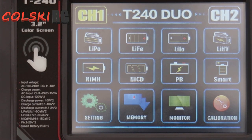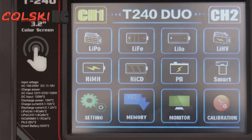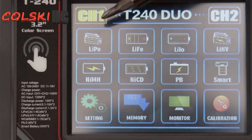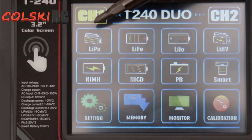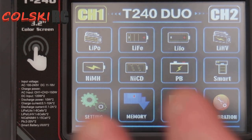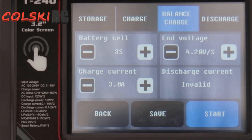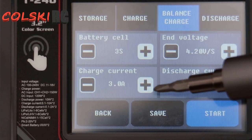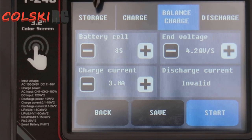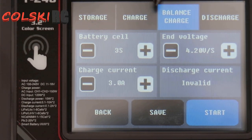So this is the view from the other camera. In channel one I connected up the 3S 4000, and in channel two I connected up the HiVolt which is for the Xeno. So if we go into channel one and press LiPo - you can see it's on 3S. I'm charging it at three amps. The end voltage wants to be 4.2 per cell. Storage mode would charge it to 50% of current capacity. Charge without balancing is quicker, and discharge obviously discharges the battery totally.